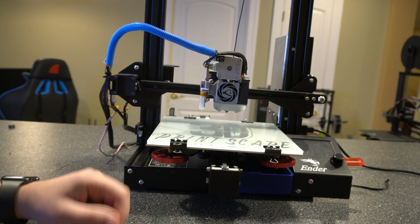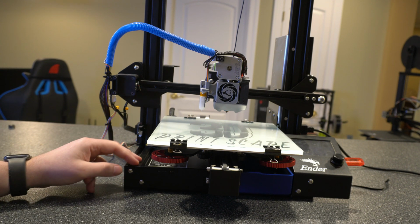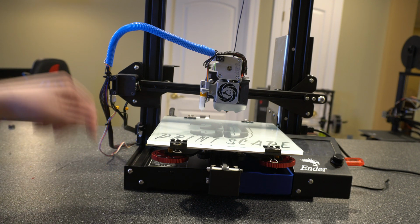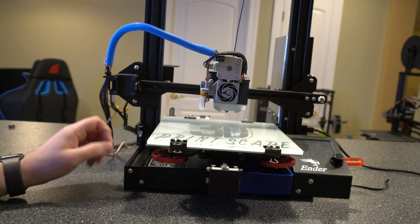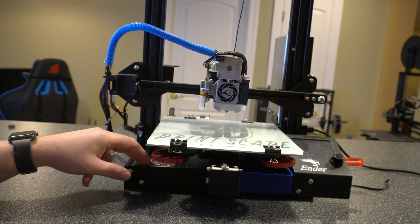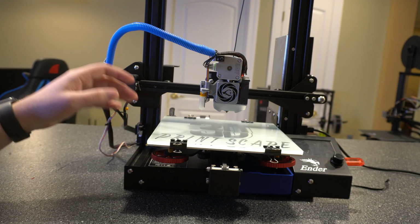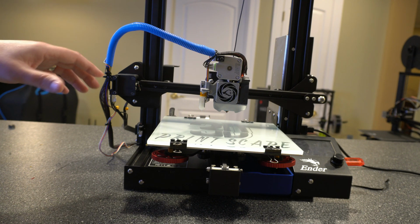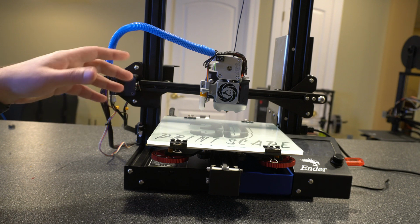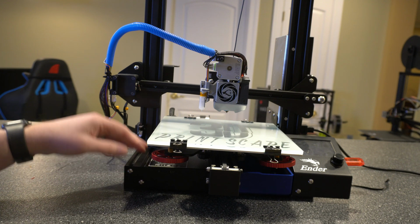All right, then I want to talk about 2 bonus upgrades. These are very specific to those of you who want to make your printer quieter. This printer right here, it came with the 1.1.4 Creality board. My other Ender 3 came with the 4.2.2. Neither one of them are silent boards. I switched this one to an SKR Mini, and I have a video covering all of that. I'll link to it in the description below. But that swap made a huge difference. The biggest difference as far as noise reduction across the board. I also tried things like putting the dampeners on the stepper motors and things like that. In comparison to upgrading to a silent board, that did nothing.